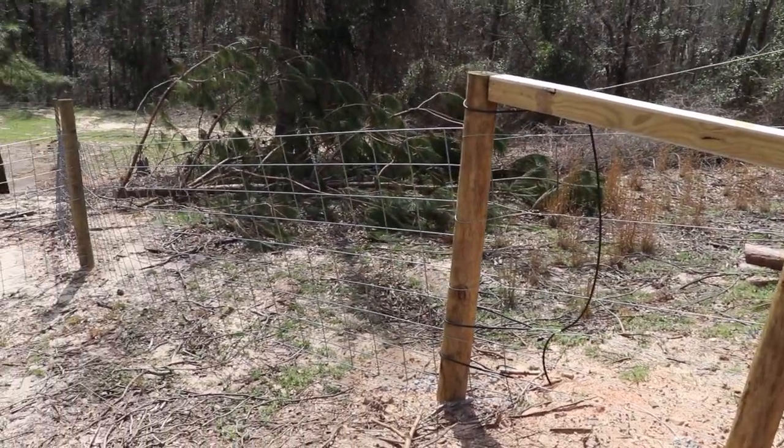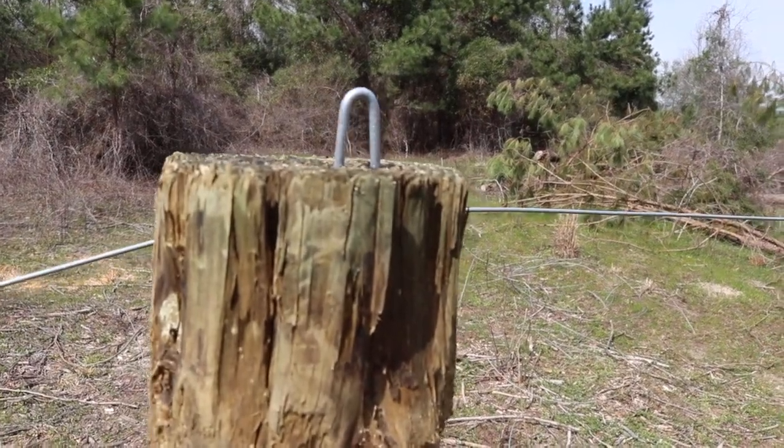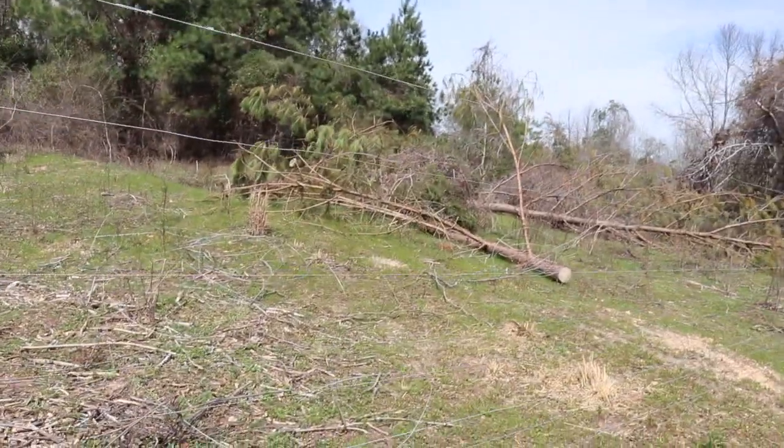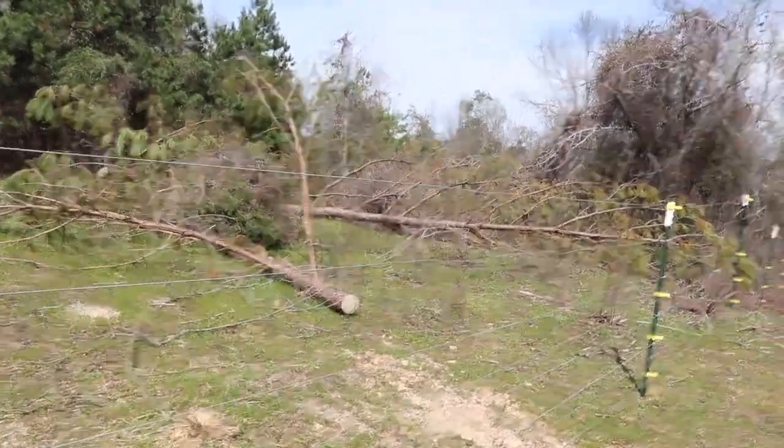As far as clearing the underside of the fence, I saw a post on Facebook where somebody was asking about the best way to do that, and I found that a big weed eater blade is about the easiest way — that's the easiest way to keep it clean underneath and keep grass and brush from growing up into your electric fence. Cattle panels we found very useful while doing this. We put a cattle panel anywhere we thought we might put a gate, even if we're not going to put a gate now. The cattle panels will keep everything in and then we can put a gate or a cattle panel there for 20 bucks — we can always add a gate later and don't have to cut wires. We cut some down to four feet so we could do some man gates in places. If you come to the top of each of your posts and drive a staple or a staple with a little bit of wire on it, you'll actually have some ability to do repairs and have everything there handy — you don't have to keep a big wheel of wire around.